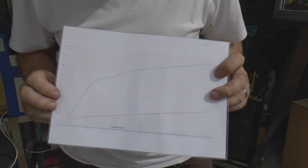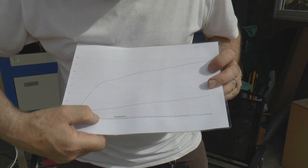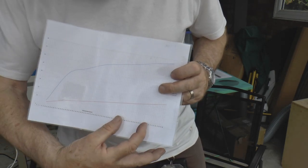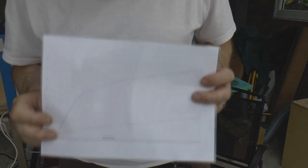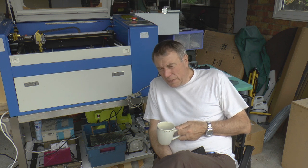I'm going to show you the calibration chart for the machine. The power characteristic is quite steep up to around 25% power. After that point, although the milliamps are going up steadily, most of the power gain happens in the first third of the range. At around 65% we're at 22 milliamps - the typical running current for a 60 watt tube - and I'm up at just about 70 watts. A lot of people think dialing in 10% gives 10% power, but it doesn't work that way because of the non-linearity of the tube output.